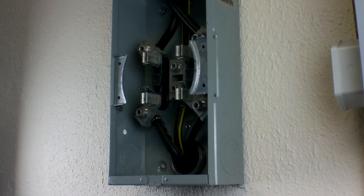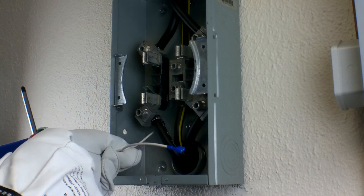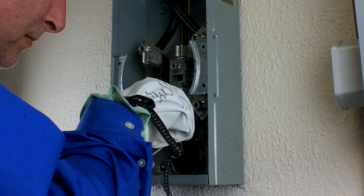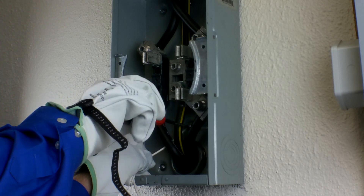there is a two-piece white neutral wire with a push connector. Our two-piece ground wire allows for easy installation without the need to hold the meter-based surge protector as you connect the ground wire. Take the short white wire from the SS320 and connect it to the neutral ground bond inside the meter enclosure.